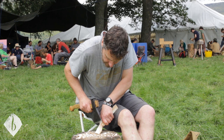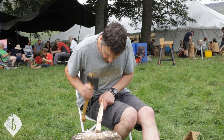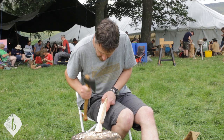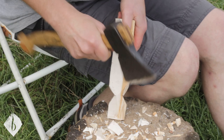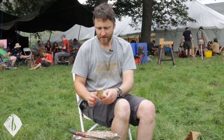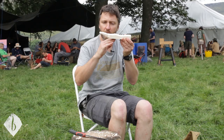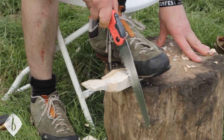Just doing the back here - quick just to hold onto this and whack away. If you're holding it there, there's a good chance you're going to have an accident. The last thing to do is just to thin down the handle. We'll get down to a fairly finished thickness because the top's not too bad - that's just going to take a little bit of knife work just to smooth off the cuts from splitting. Down the middle again - working in those thirds just makes the axe work so much easier. So we've done the underneath of the handle, I've just got to do the underneath of the bowl now.